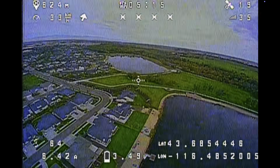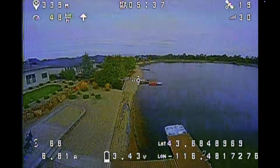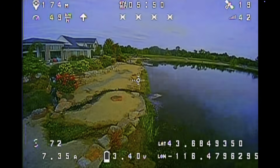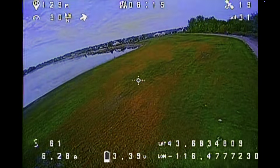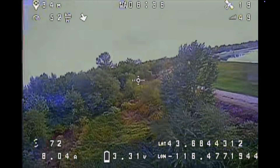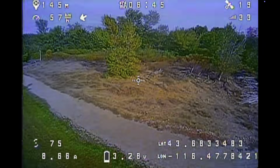On to the things I've loved about this little quadcopter. The first is obviously the battery — I never thought such a big battery could fit on a teeny little quadcopter, but it is amazing. I get over 10 minutes of flight time with semi-aggressive maneuvers, and that was after it sat in the grass for about five minutes while I was trying to find it after a crash. With careful cruising and going down pretty far on battery voltage, I bet you could get over 20 minutes easily with this same setup. The next big plus is the price — all budget parts, around 100 bucks total, and even on that budget you're getting a GPS, which is just insane. I've loved being able to see my speed, home direction, and distance from home. It's more of a mid-range build, but it wouldn't be long range without GPS and it has it.